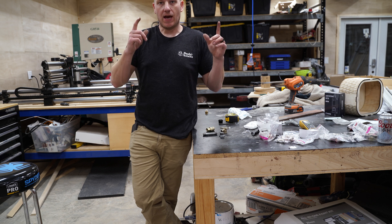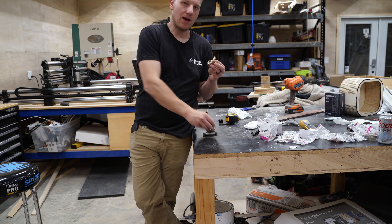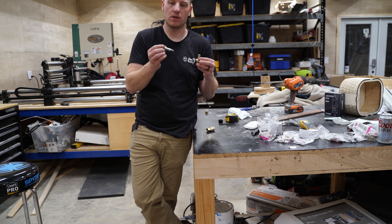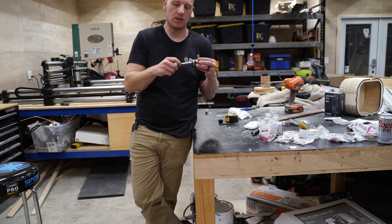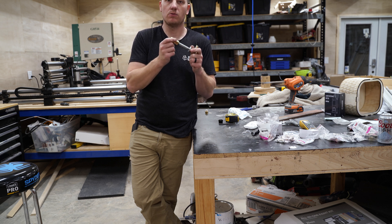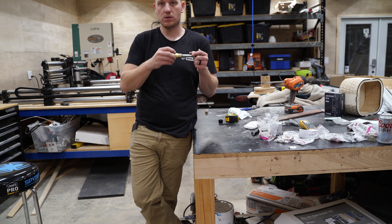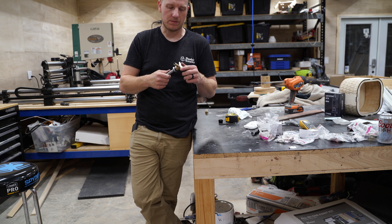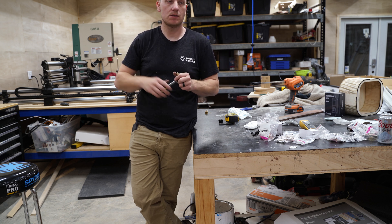Back at the bench — this is what we're going to do to get from the attic into the shop room. We have an elbow 90 with a threaded half-inch, and a half-inch to quarter adapter that threads straight into it — brass to galvanized. Now we have a galvanized quarter-inch three-inch pipe, and the goal is to get this pipe to come through the drywall and drop down into the room. We're going to use a quick disconnect threaded into the end, so everything in the shop can have its own auto shutoff without a lever. If you need to address a hose reel or a tool, you can just disconnect it here. We plan to have four — two for the cord reels, one over the CNC, and another by the door.